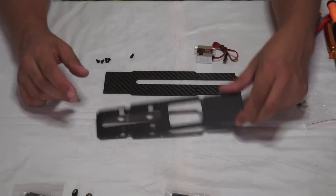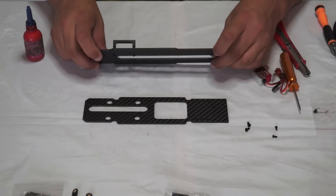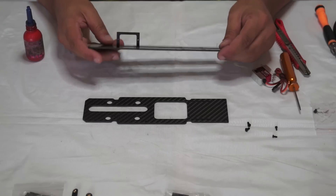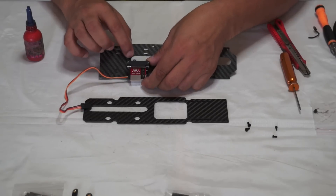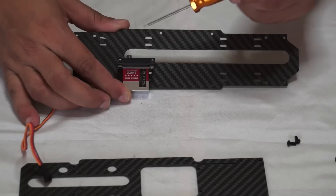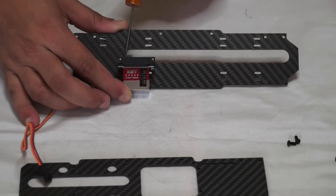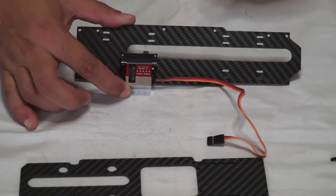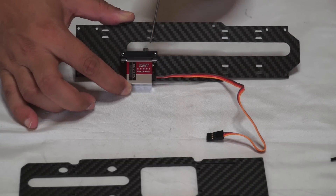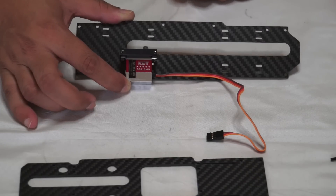You have to make sure that the connecting rods move nicely inside. Loctite is your best friend. Servo bracket is mounted. Remember that the servo gear cannot be at this side — because this will lock the servo arm and the servo arm cannot move to its full extent. So make sure to install the servo so that the servo gear stays at this side, and we will have enough space for the servo arm to move and tilt the rotors.